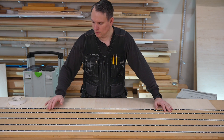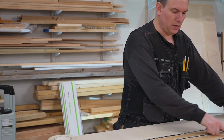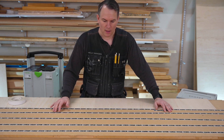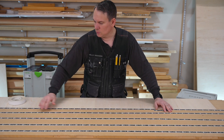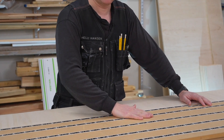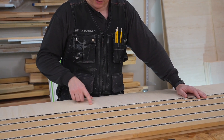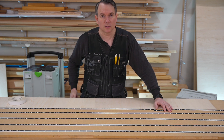I've set up my workstation here for cutting with Shaper Origin. It's a handheld CNC that uses marker tape to figure out where it is and locate its position — it's kind of like GPS for the tool. I've used this board over and over again rather than wasting tape. It's a permanent board I use for multiple projects, made from ¾ inch MDF — the same thickness as what I'm cutting — so the Shaper Origin can slide over the surface. Underneath I have a half-inch MDF spoil board that protects my workbench when I cut a few millimeters deeper.